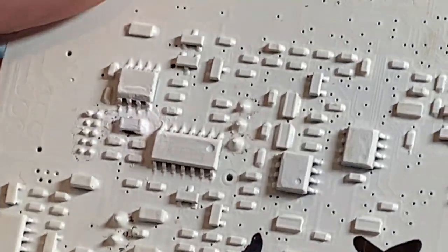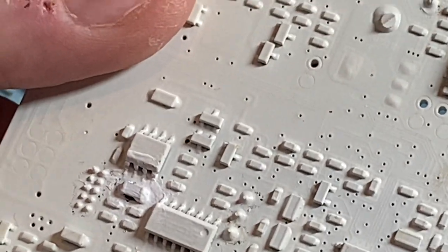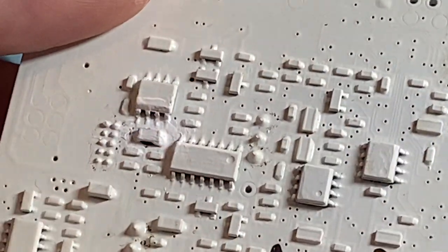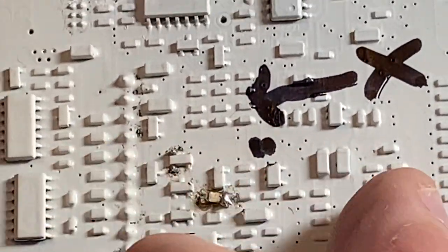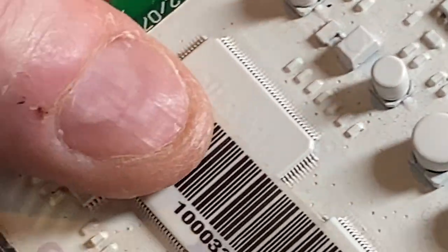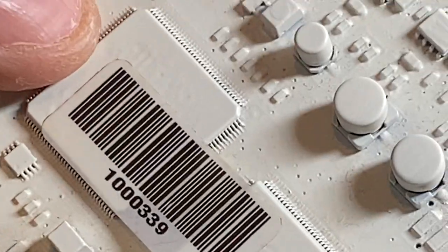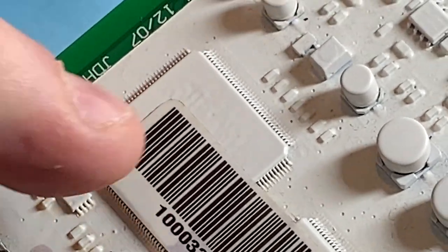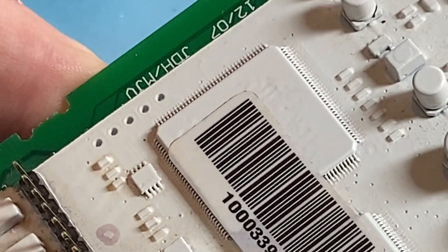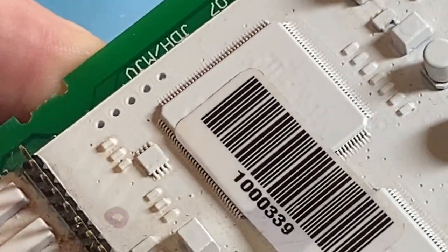You can really break it down into your receive, power supply, timing, area, audio. Some audio switching's done in this main processor. Who knows what goes on in the main processor? If you want to probe it out, you can. It's a pain in the proverbial. I wouldn't admit to doing it, but I have.